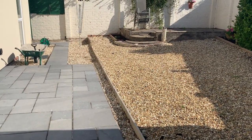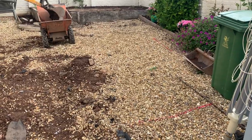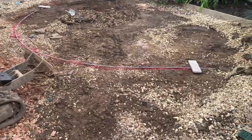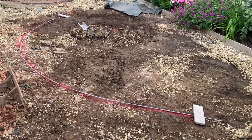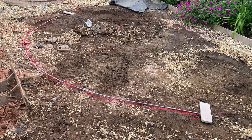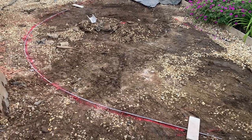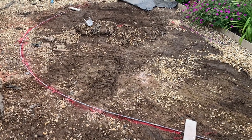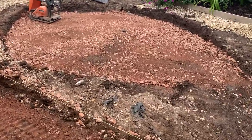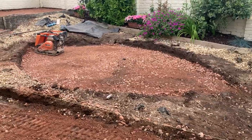We're going to do all this, so that's going to be fun — a bit of a dig out on the oval. We're going to get that shape going. We're marking out the oval for the other patio now. I've been using tent poles — connected a load of tent poles together, put a bit of a curve in it, and perfect, got my oval sorted. That's 100mm MOT compacted in two layers.